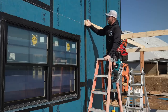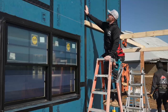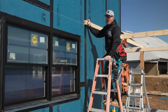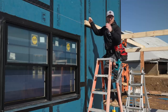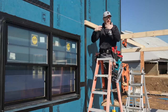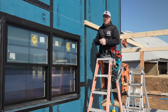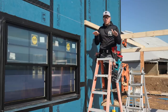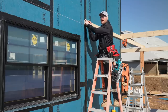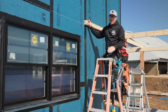We've got a detail here that we thought about but now that we're actually building the porch we're going to do it a little differently. Originally we had blocked up here, but we talked to our truss manufacturer and ended up changing to a two-foot-on-center residential-style truss instead of an eight-foot-on-center porch truss. Because the client changed to a vaulted ceiling matching the inside with a wood ceiling, my engineer had to spec a double LVL — nine-and-a-quarter or nine-and-a-half inch — that's going to attach to this wall and span across. We're only spanning eight feet so it's a very small span for a double LVL.